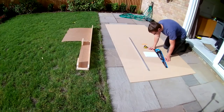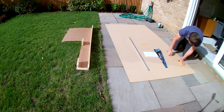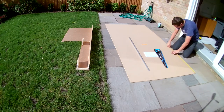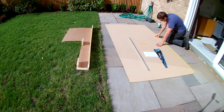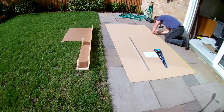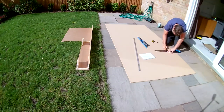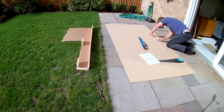This time I've bought a sheet of 9mm MDF, which is much stronger. As before, I need to start off by drawing the required shape on the board, and I'm going to use an edge cut by the professionals to make the long vertical edge that's most exposed, since I expect them to cut much straighter lines than I can. Sadly, I don't have room for a table saw. The saw sees use as a 90-degree guide — it works well for this, although sometimes the teeth do get caught on things.